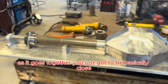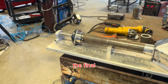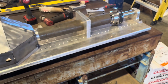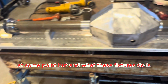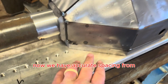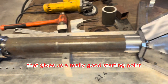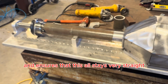That's why none of this is really critical as it goes together — you just have to be basically close, because that bar is the final setup. We built this fixture to build housings on, with the plan to build 20 or 25 of these a year at some point. These fixtures give us accurate spacing from the faceplate to the center line of our axle tubes, ensuring everything stays very straight.